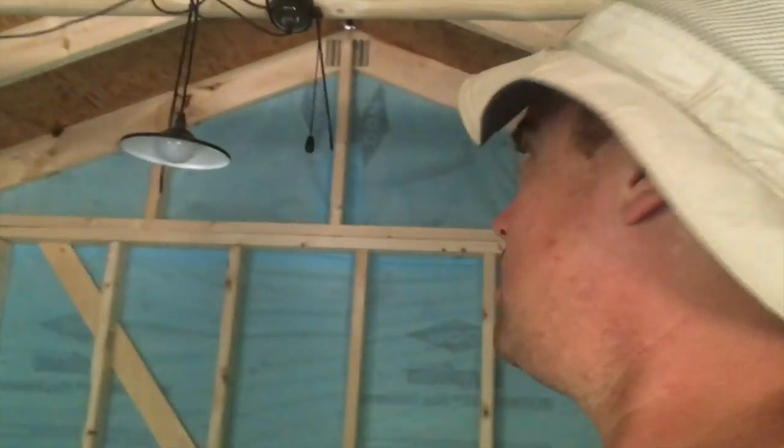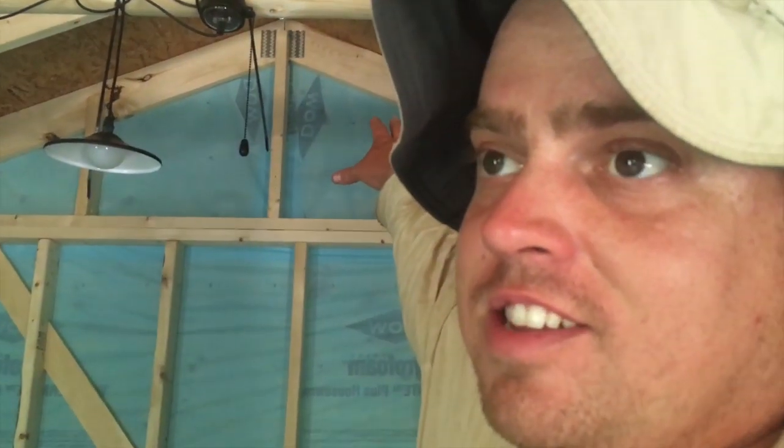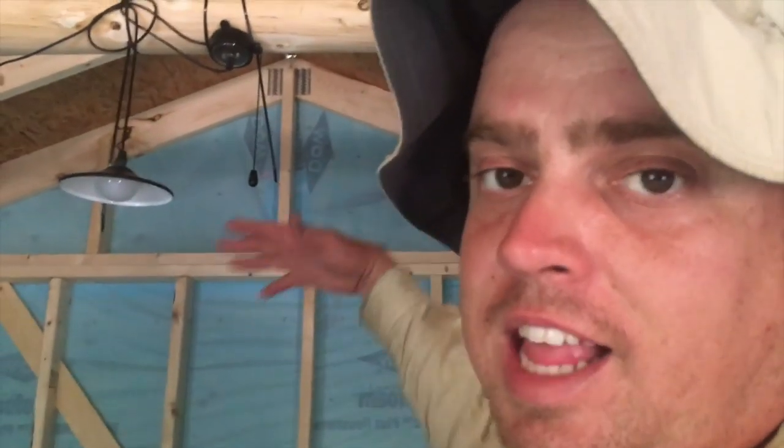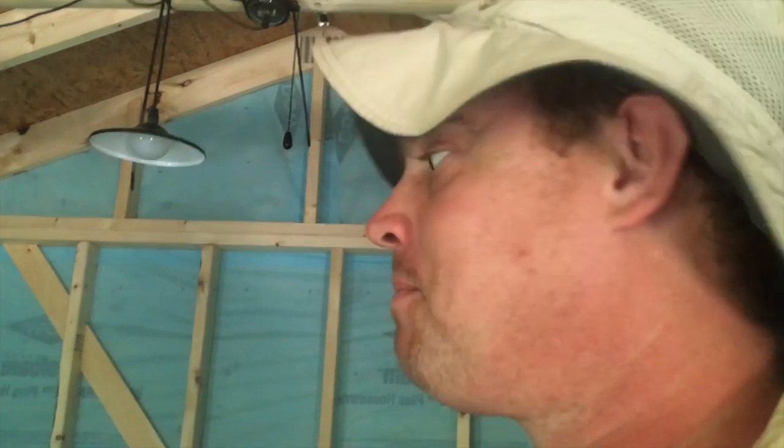You know, the pine wood warms up really well in the winter, but it holds heat a lot in the summer, and this cabin's so small I'm not going to have a problem heating it in the winter. So I really need to figure out ways to make it as cool as possible during the summer, including a window up there. I didn't put a window on the bedroom here for security purposes, but I'm realizing I want a high window that's not easy to get to, that will let light in and that I can get a cross breeze going through the back room here.